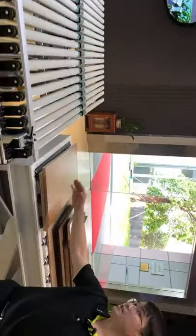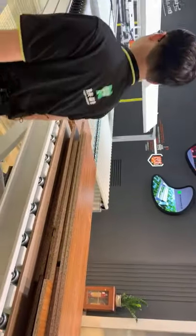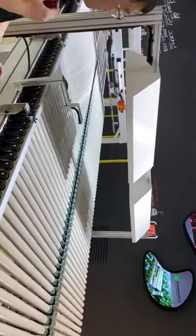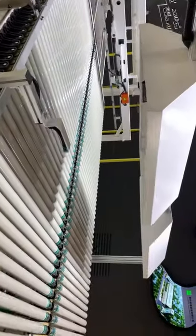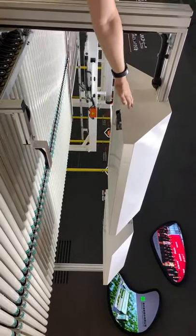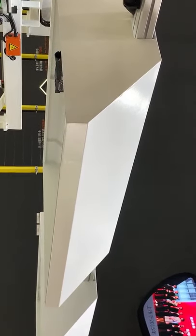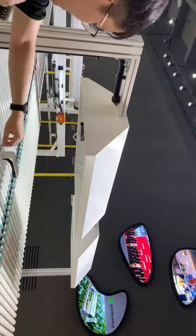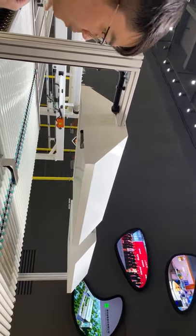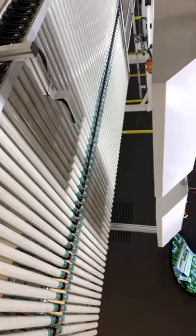As we can see, this is the start of the line. Here is the barcode scanner and QR code scanner. The labelling can be QR code or barcode — we can preset the program to scan the QR code; this is the camera to scan it. After we scan the barcode or QR code, the workpiece will go through this area and into the measurement device.